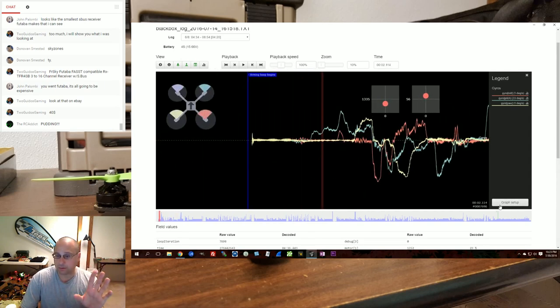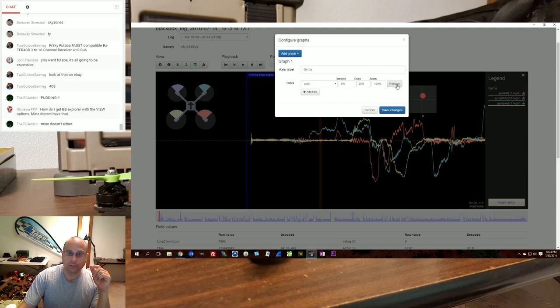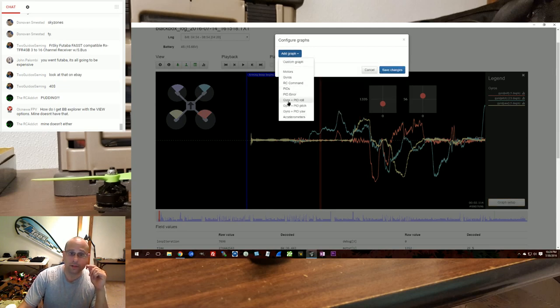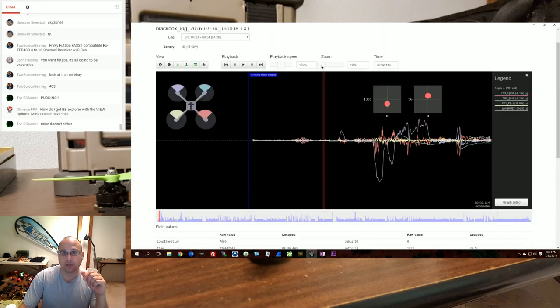That's good. It's just like when you go to the doctor and the doctor takes your pulse and checks your blood pressure, right? Every time I look at a log, the first thing I do is look at the gyros to see if there are any crazy problems. If you go to the doctor complaining that your knee hurts and your pulse is 180 and your blood pressure is through the roof, they're not going to look at your knee. They're going to fix that problem first. The gyros are kind of like that. Now let's look at the roll axis, which is where I like to go next, because the roll axis is usually a lot more active and will tell us more about the tune. I'm going to zoom back in.